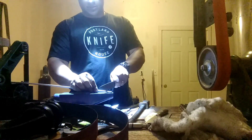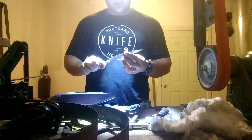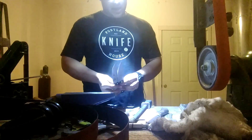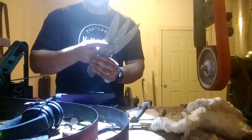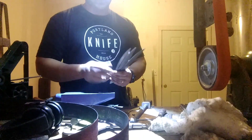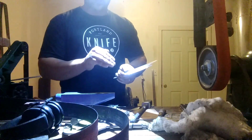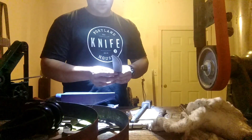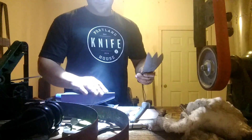This one seemed to hold up a little better. Only the strong survive — so these guys didn't make it. We're going to take the survivors and put them at about 15 thou behind the edge, maybe 12 — I'll try to push that line. But with 8670 at this heat treat it can't be pushed to nine thousandths. Could it be the heat treat? Yeah, it definitely could be. There's lots to explore — nobody has the exact science behind all this stuff.